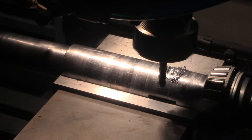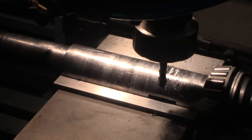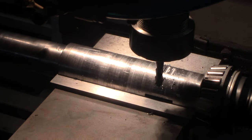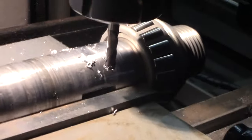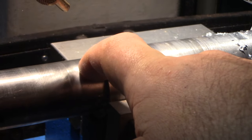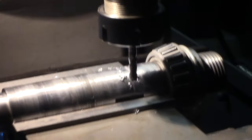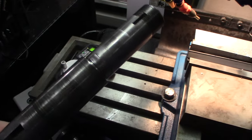I just go back very slowly. That should be enough - turn the spindle off. Perfect. I just need to recess it enough so I'm not going to create that marring again on that gear. The set screw, when it does mark it up, is going to mark it below the surface, so it's not going to screw up the gear collar fit again. I'm going to do the same thing on the other side too - that's another spot where the collar grabs.